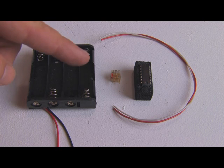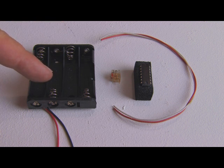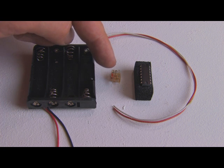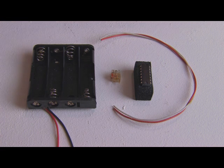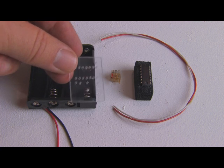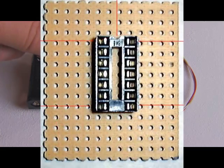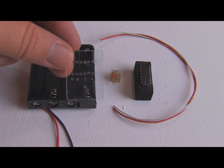Here's all there is to it. You've got a battery pack that'll be six volts. You can even use lithium cells, a couple of real small ones if you want to make a miniature version. You've got a little trimmer capacitor here, and you've got your FM transmitter chip. I've also got a little piece here of plastic, which I have drilled to hold the chips and the capacitor. Ordinarily you'll use perfboard, but I just used a piece of clear plastic for the video so you'll be able to see where every wire goes.